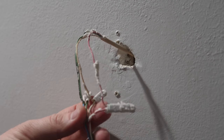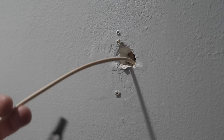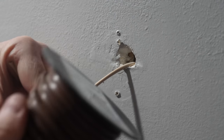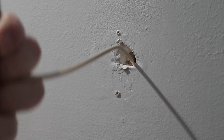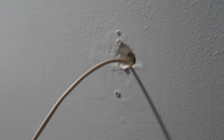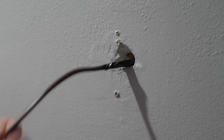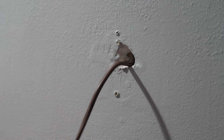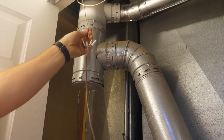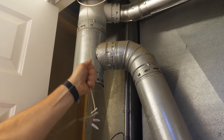What we're going to do now is splice the wire here and tape on our new thermostat wire so we can feed it through to the thermostat. I'm cutting off that extra wiring and then taking the new wiring and using electrical tape to tape them nicely together — making sure it's a smooth, non-bulky join — so that it can easily slide through the wall. Here is my finished tape product; you can see it's not very bulky.